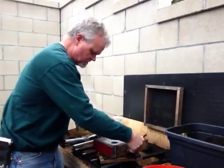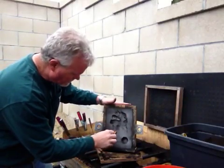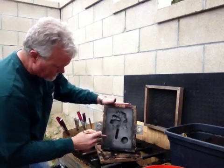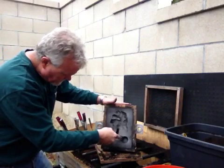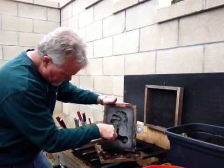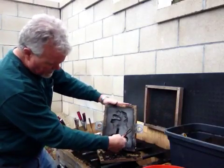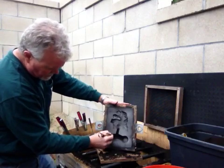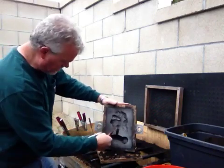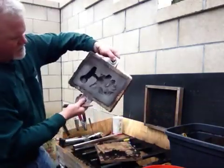Since I have this out, I'm going to cut the gate where I want the metal to run into. I come to the top of the head here and cut the gate. But instead of going straight in, I cut a little bit deeper. What this does is that allows, as the metal pours in, the metal can come past the gate and any dirt that gets washed down when that metal first pours in — that metal bypasses the gate to go into the cavity.